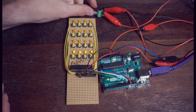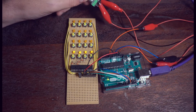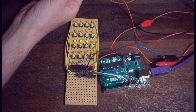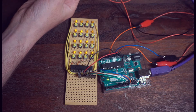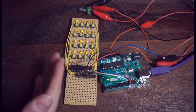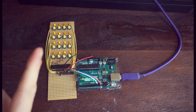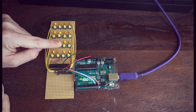However, in order to light up multiple rows at the same time, we'll need to take advantage of that same multiplexing trick we did before. Now we're looping through each of the rows of the LEDs, and the speed at which we iterate them is controlled by a potentiometer going to one of the analog inputs of the Arduino. Let's turn up the speed — now we're multiplexing this display and we can turn up the rate until we no longer see any of the rows being off; they're just all on at the same time. Now I'm going to program a really simple sequencer that's just on and off when one of these LEDs is illuminated. Now we're counting from 1 to 16, and we can use the buttons to toggle off and on any of the steps in the sequence.